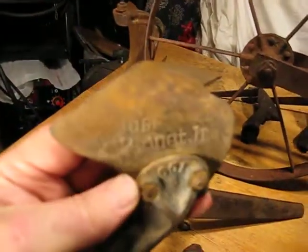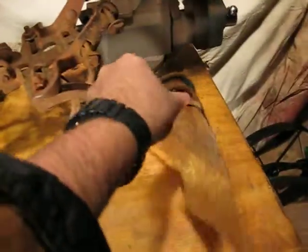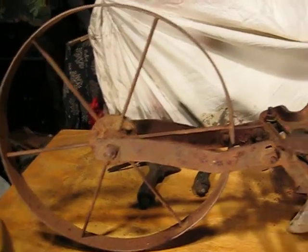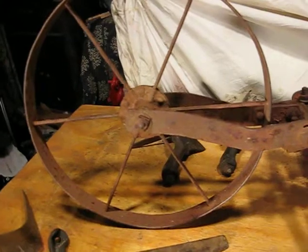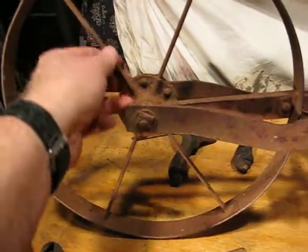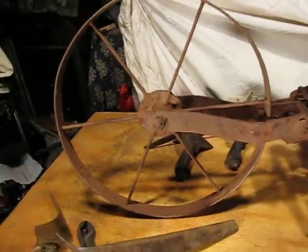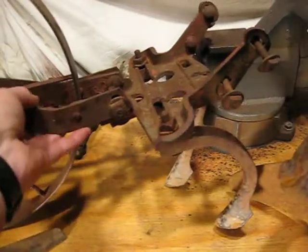Planet Junior has their name embossed on everything. This wheel is a little bit different — I've got another moldboard plow here and I'm assuming it's a later model. On the wheel of the other one, the hub is actually a combination of pressed steel and cast iron and it had a grease fitting on it. This one is actually two pieces of pressed steel with these all pressed steel here, riveted together, and there's no grease fitting on it. So I'm assuming this is a later model and they probably cut production costs by eliminating that. It's in pretty good shape — they're complete anyway.